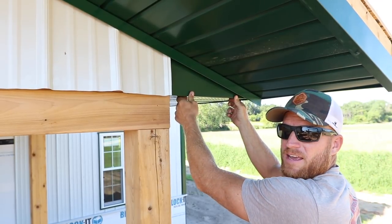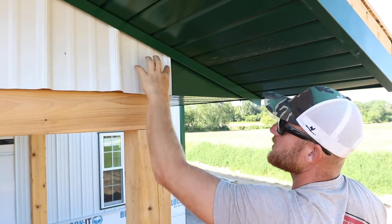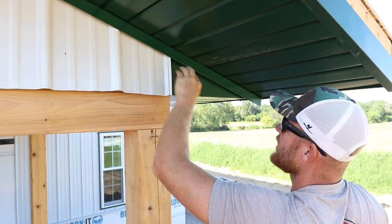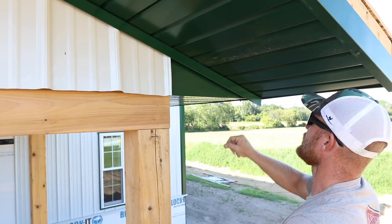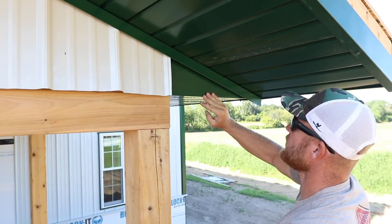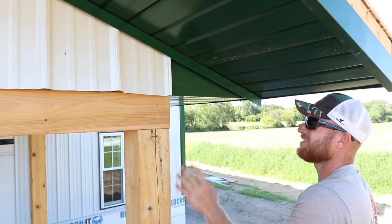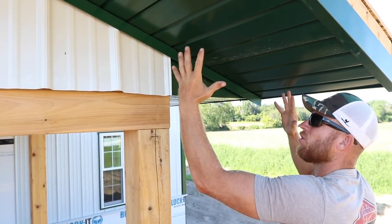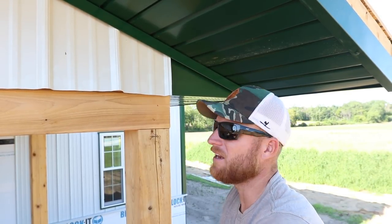Now, I've got this guy here. I'll go ahead and put my trim here, but you can see this will solidify this, and when I secure all of this in place, it's gonna make this a really nice detail. I think it cleans it up really nice and obviously terminates your eave soffit and returns it up into your gable. So I think that looks nice and it's minimal. It doesn't have this big bulky box on it. So hopefully that helps somebody. Go ahead and leave me any questions that you might have, and I'll show you this detail all finished up as well.